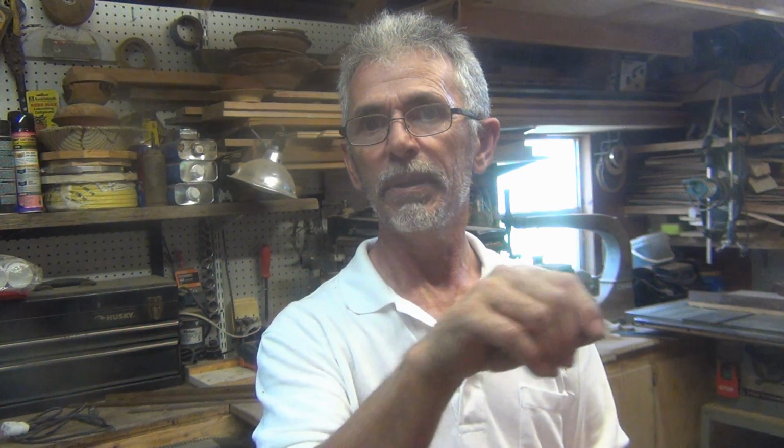And if you're a little bit of a handy person, a hands-on person, I'm assuming if you're doing woodturning, you have a little bit of ability under your belt. If you have a little bit of troubleshooting and figuring out things, you're not limited because you buy a lathe that you have to jump belts on. That's what I had to do, but I upgraded to a VFD drive, making it electronic. I upgraded the riser blocks, making it a 17-inch lathe, almost 18 inches on the bedway.